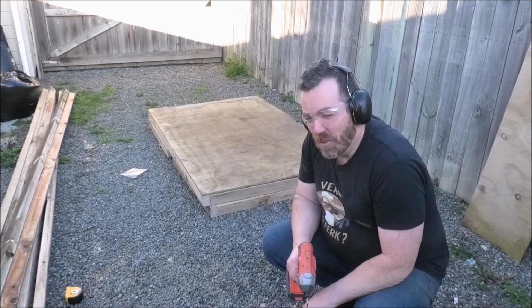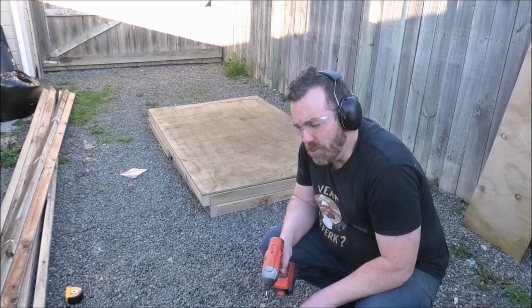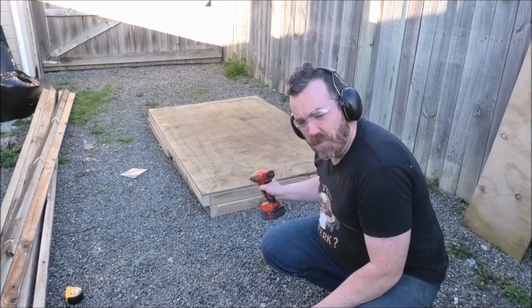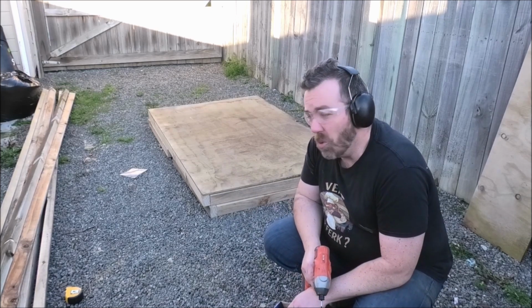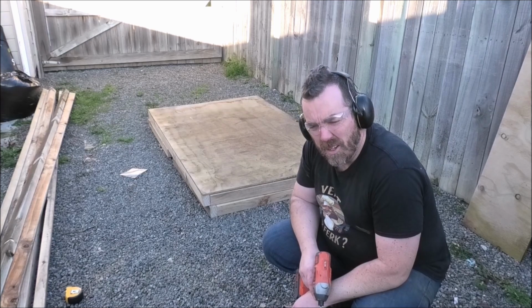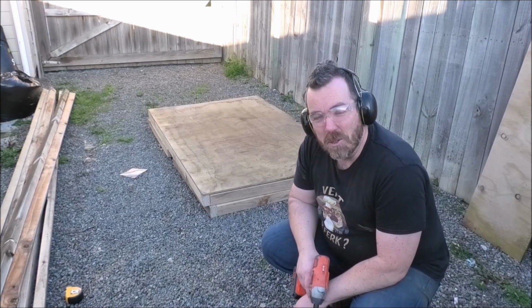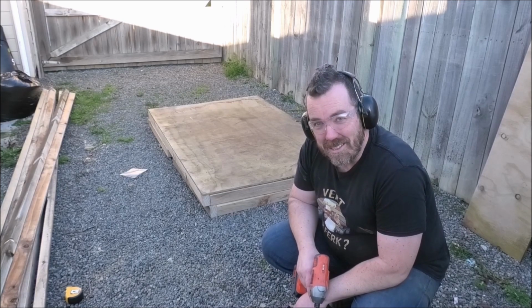It would be normal to put the external cladding on after the framing is all assembled. I'm just going to put the plywood cladding on this wall first before I put the shed up, because this wall is going to be facing the garage and there's not going to be any room for me to get in there and easily attach it then.